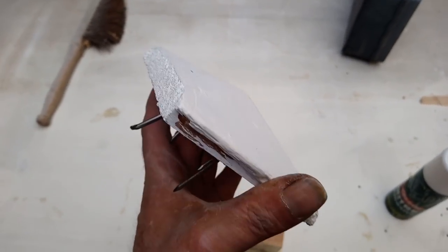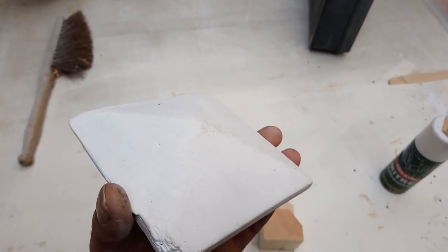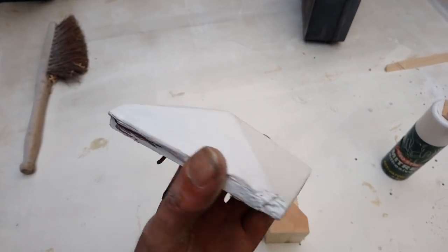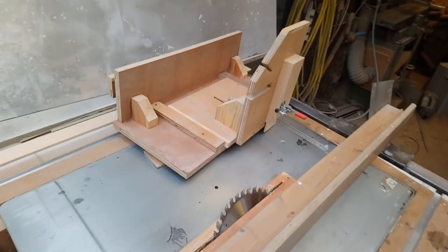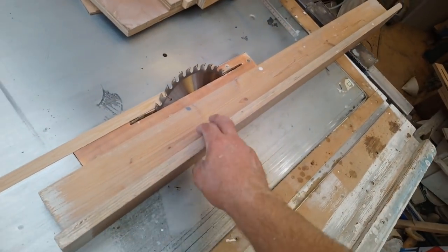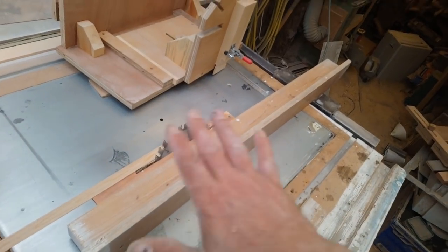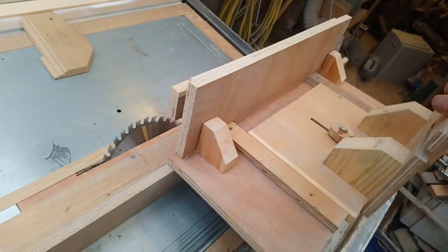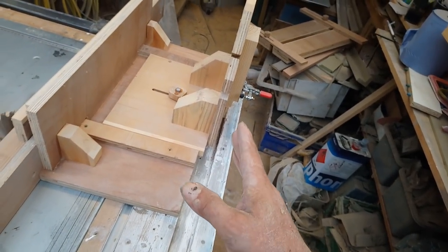Right, I've got to make one of these for the top of the staircase newel. See, somebody's cut that edge off. So I'll cut a piece of wood to this thickness and size. I was going to do it on my old tenoning jig that I haven't used since I bought the Domino, but it sits this side and it's set up to go on that side. And because of the tilt of my blade, see how it sits on there, but my blade's going the wrong way.